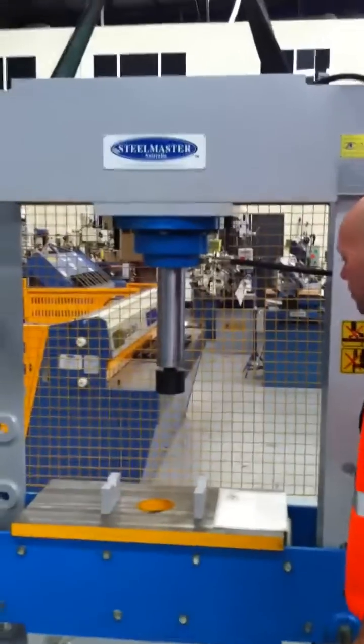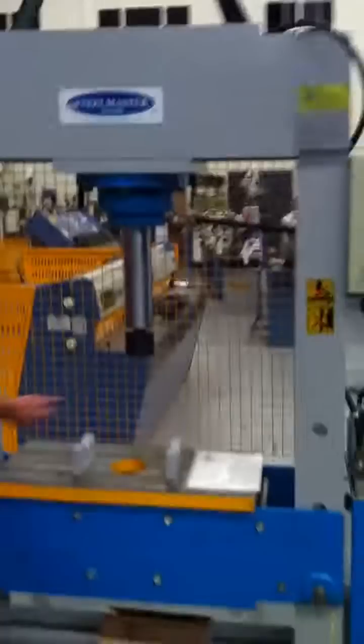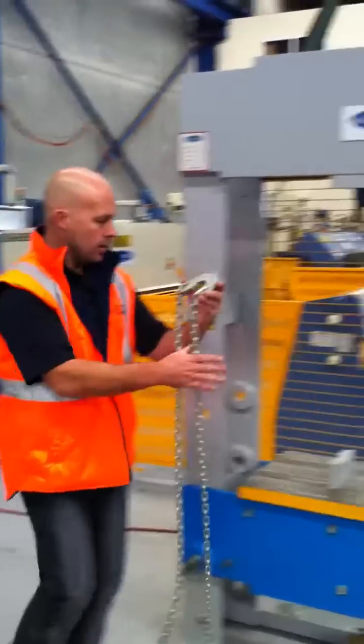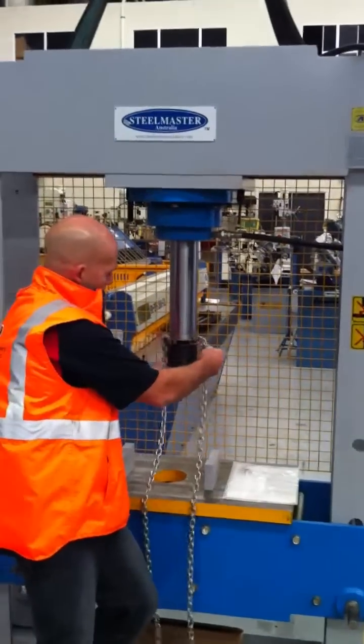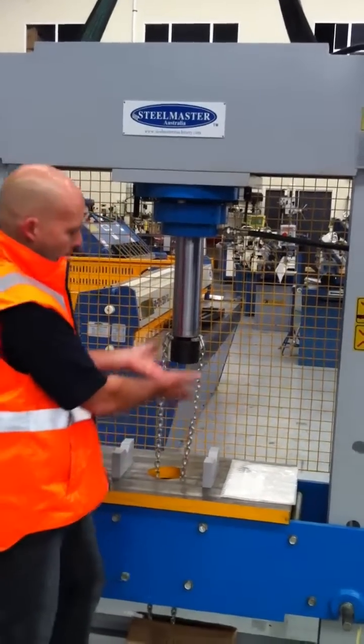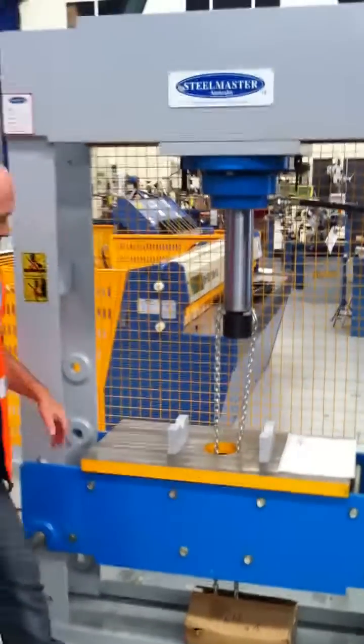Great stroke there. That's in the backing position. From this little rack system here, we've got a lifting device. Simply put the lifting device on here, throw it through the table, lock it in, and then pull the table up. Release your locking fixtures, and then put the locking fixtures back into the table once you've got to your desired position.